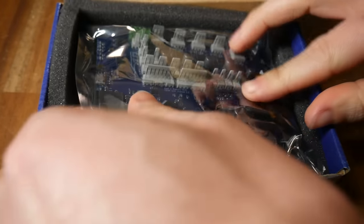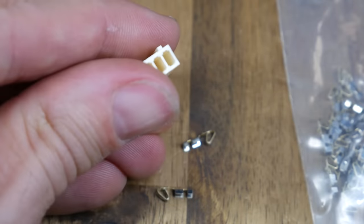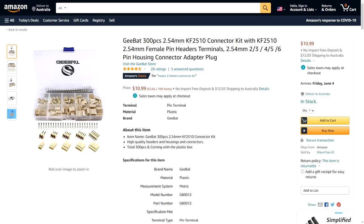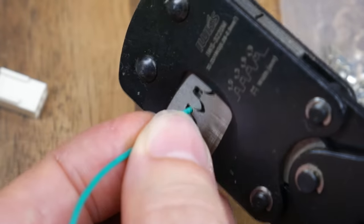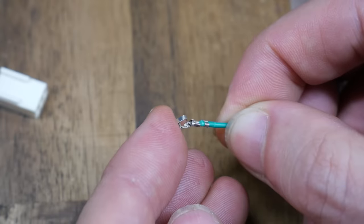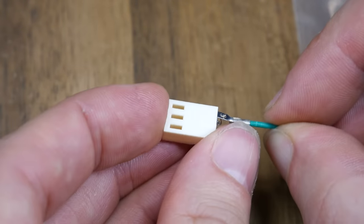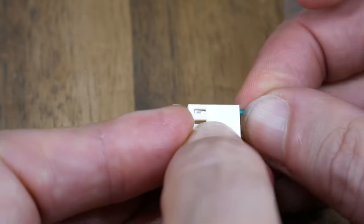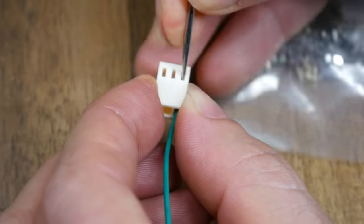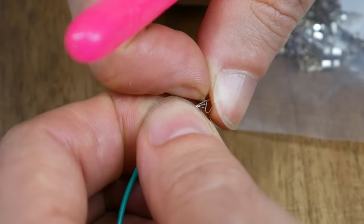Chinese boards usually use JST-XH, but the other type we see on Duet hardware is a Molex connector, again with a 2.54mm pitch, and a chunky housing that can only be plugged in the correct orientation. Duet supplies the connectors when you buy the board, but you can buy extra online if you need to, and they're crimped the same way we've seen so far. Strip the wire, insert the terminal into the crimping tool — it also has a wide and narrow end — insert the wire, squeeze down until it clicks, and we have our finished crimp gripping both the exposed wire and the insulation. This connector also has a raised tang on the terminal that needs to line up with the cutout in the plastic housing. Once pushed in far enough, it flips up and prevents the terminal from pulling out. Like all the others, if we use something pointy to push down on the tang, we can remove the terminal from the plastic housing, and if you're going to reuse it, make sure the tang is pointing upwards enough.